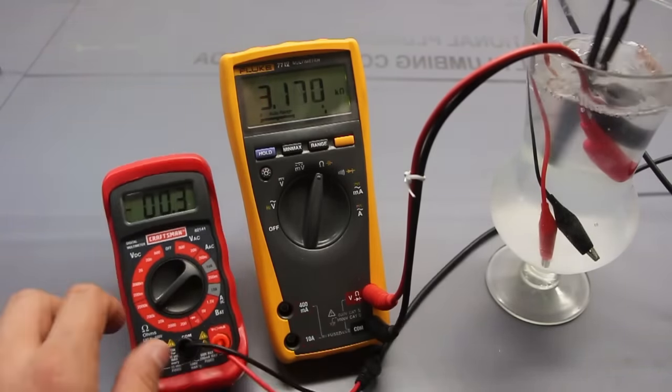So what I'm gonna try now is to go down to this one, because I suspect that this is one set and this is another set. When it's open as it is right now, these two are connecting, these two are disconnecting. When it's closed, these two are disconnecting, an open circuit, and this becomes a closed circuit, or it's connecting. Just what I'm assuming, and we can test that theory right now. I should hear an audible noise if now these two are connected, if my theory is correct. And indeed, that's exactly what's occurring.